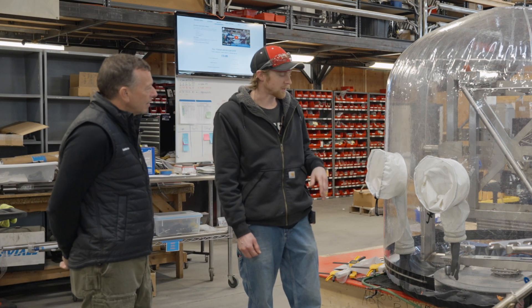From there, we had to go into a whole engineering side. Gabriel's team would be sent drawings from our engineering staff, and they'd build up gear. We have a couple here from the testing — a lot of them we were testing things to destruction. We were also testing things to make sure the weld process was right. We cut some of these and looked at the insides of welds. One of the first ones failed because the weld wasn't purged on the backside of the tube — it caused a little crack that after about 400 landings started cracking. We've gone through many iterations of this gear and hundreds if not thousands of landings during the process, and all of that resulted in changes to the design over time.